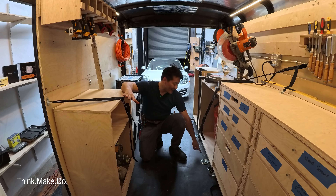Right now I have a battery-powered supply running everything, but long-term it's going to convert to a 120-volt to 12-volt LED driver mounted on this electrical wall. For the main power source, there's a shore power plug connected to a regular extension line, so I can hook into any job site and have power. I also have a master kill switch so I can leave it plugged in and just make sure everything's turned off. I've got multiple four-outlet strips — so four outlets, another four, another four, and one more.